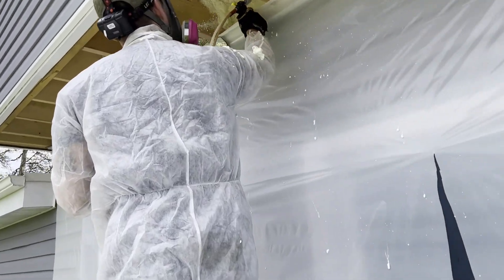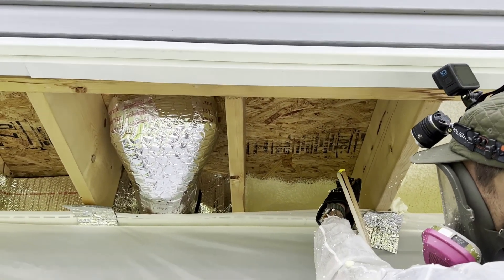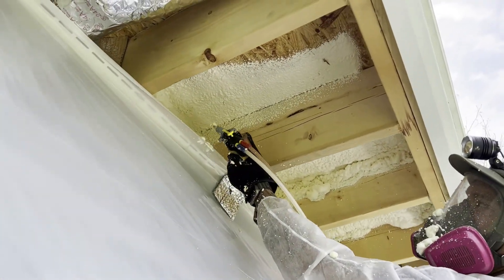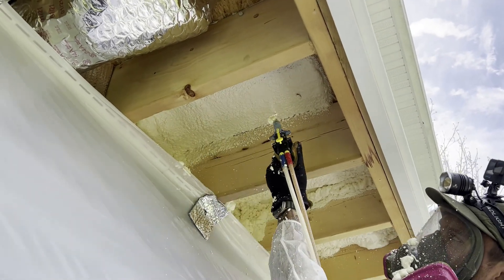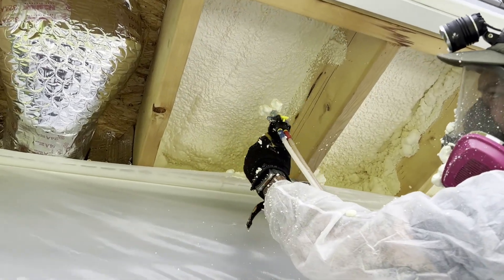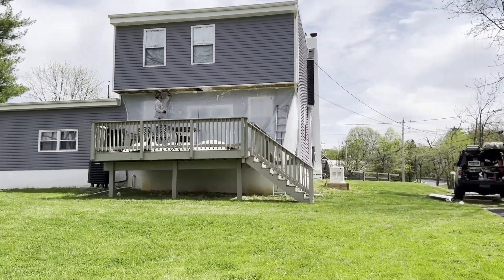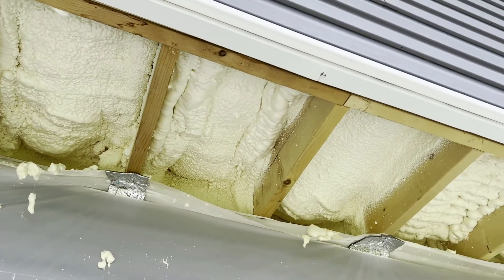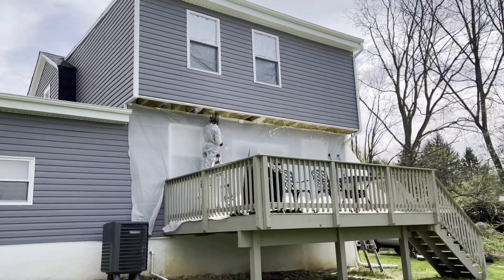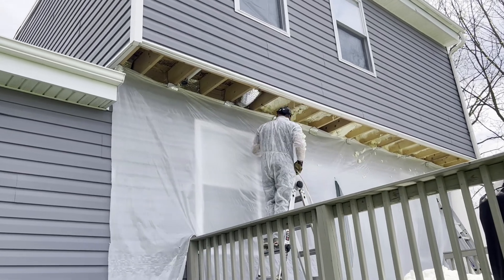So tell me a little bit about how this part's going. It's going well. The way that I do it is I spray an even span this way, and then one straight back. But as the pressure starts to drop, you have to drop the passes and go almost like you're painting — overlapping. You want to make sure that while you're spraying, you're the same distance away and even with your overlaps. This is coming out pretty even. I'll spray enough to where it'll settle down a little bit, wait until it settles, then go back over and spray more to make sure it matches up because it expands as it's going. You don't want to overspray because it's really expensive, and you don't want to underspray — that means multiple trips.